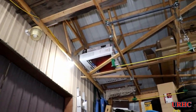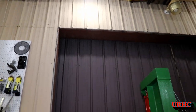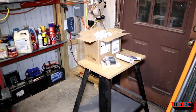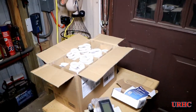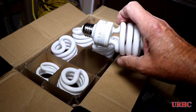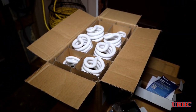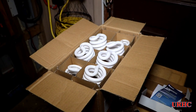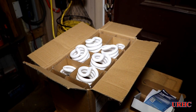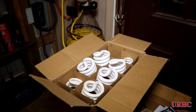I did this about six years ago and you can see they're all LED bulbs now. Up till last week I was using CFL type bulbs which drew 22 and a half watts. I just switched to 15 watt 1600 lumen LED bulbs from Amazon. I have 15 bulbs in the building, so that's 225 watts total I should be using.